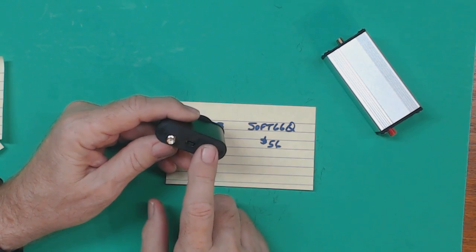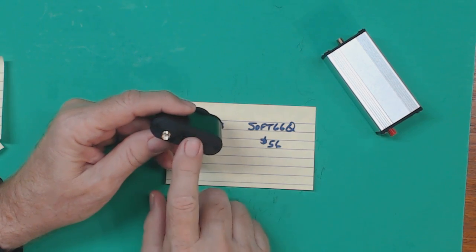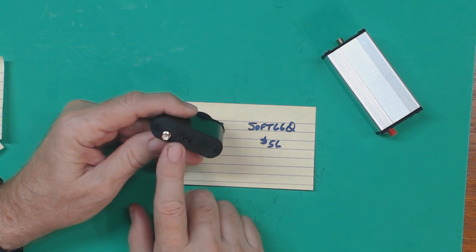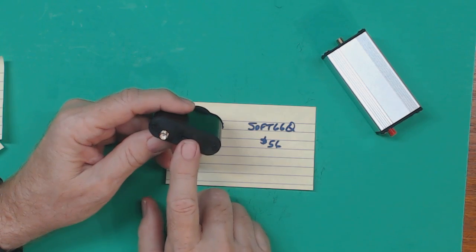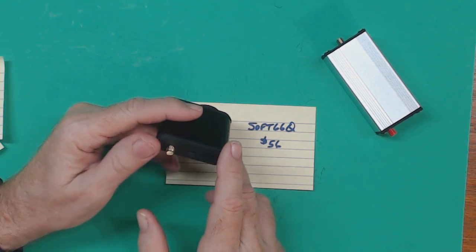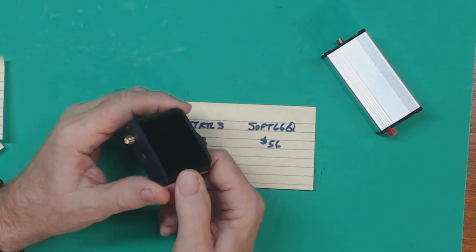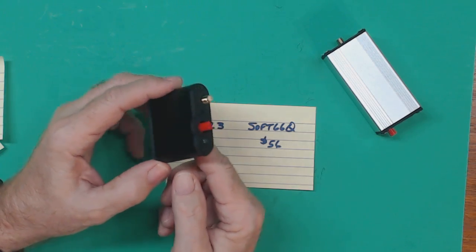So if you want 7 megahertz, you have to dial in your software 57 megahertz. So I went back and did that, and sure enough, I found some of the stronger signals because, like I say, the HF bands are pretty dead right now. And it seems to be working fine. It was just operator error. It's a neat little package.